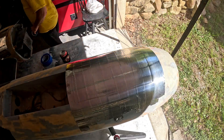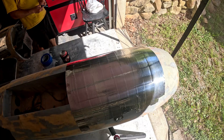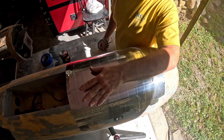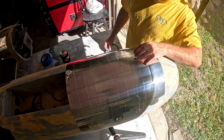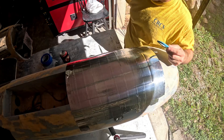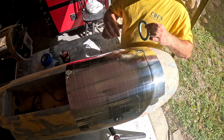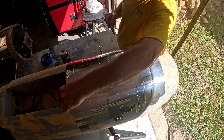As you can see, I now have the foam blanks for the gear doors sanded to shape, and I've covered them in aluminum HVAC tape. The original green stuff I was using didn't stick very well, so I switched to the HVAC tape. Now I'm going to take some vinyl masking tape and outline the gear door area on all of these.